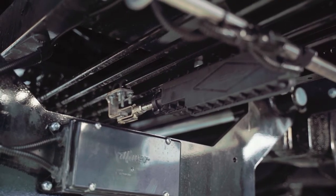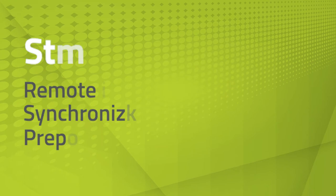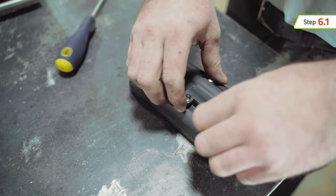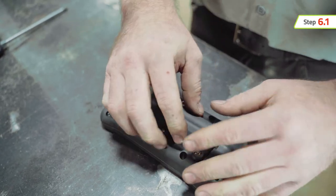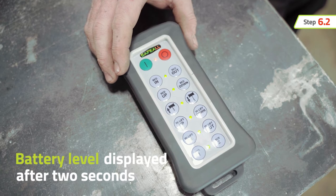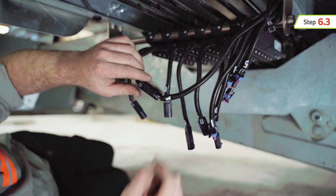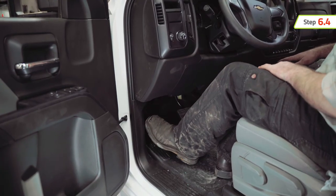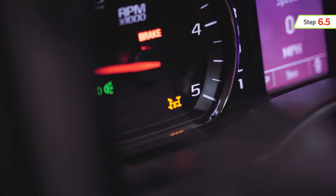After the SafeVal remote kit has been properly installed on your car carrier, it's time to synchronize and calibrate the handheld keypad and actuators. Remove the battery tray cover by removing the 4 cover screws from the remote. Install a 9-volt battery and reinstall the cover. Press the green power button on the remote, which will illuminate the red and green LEDs confirming functionality. After 2 seconds, the green LEDs will display the battery power level. Only one actuator at a time can have power when syncing — all other actuator power sources must be disconnected. Connect only one 2-prong quick connector at a time when synchronizing. Set the parking brake and start the engine of the truck, then engage the PTO.